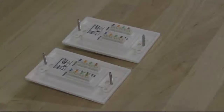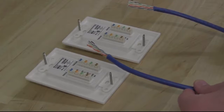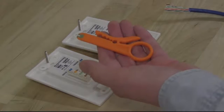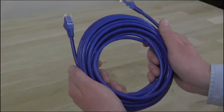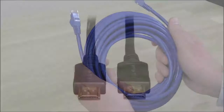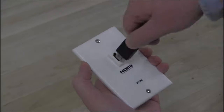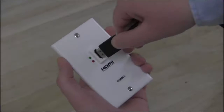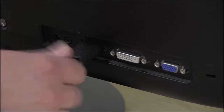This kit is fairly simple to install. On the rear of each plate is a 110-type punchdown panel. Simply match the color wires to the color codes, then use the included tool to punch down the wires to the backs of the plates. You need two CAT6 cables when you punch them down. Once you've completed your CAT6 termination, take an ordinary HDMI cable, plug it into the source wall plate, then plug the other end into your DVR or cable satellite box. Then, on the display side, plug an HDMI cable into the other wall plate and connect the other end to your display.